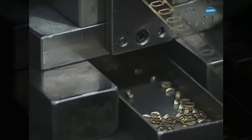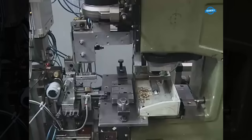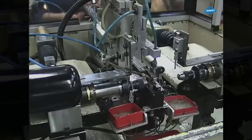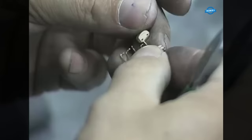Fashion bracelets begin with gold preparation, where the gold is rolled and flattened to achieve the desired thickness, ensuring it is malleable and ready for shaping. The style or design of the bracelet is stamped out, creating a three-dimensional pattern using specialized machines. The back of the stamped piece is closed and finished to give it a solid appearance; holes are drilled in the sides to allow for hinges or pins that give the bracelet flexibility. Some individual pieces may require hand assembly, where wires acting as hinges or pins are carefully inserted, soldered, and clipped away. Finally, the sides of the bracelet are meticulously finished through grinding, lapping, and polishing, giving the piece its final look.